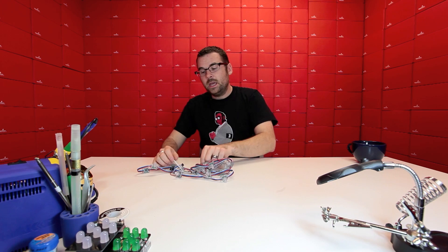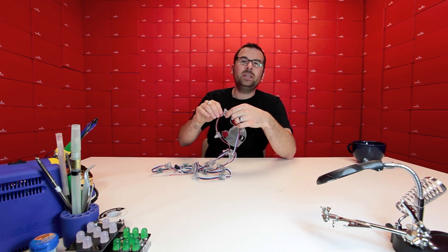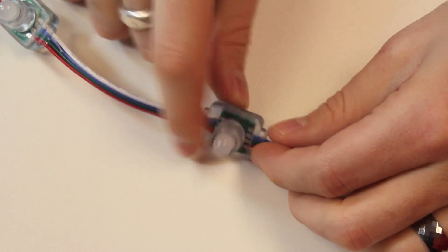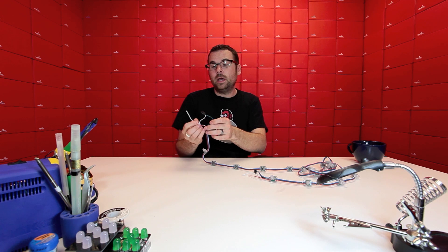I've done a lot of these videos and we've talked about addressable LED strips in several of them — I kind of get deja vu every time. Here we've got yet another addressable LED strip. These are slightly different than the waterproof self-adhesive strips we have. These come in 20 LED strings, more like a Christmas light. Up close, you've got an LED embedded in a little silicone rubber enclosure, and on the back are the IC and all the electronics. These use the WS2801 IC, same as everything else we carry, which allows you to individually address each LED and change its color. You have power and ground on one end, then your signal, and you can daisy-chain as many as you want together.